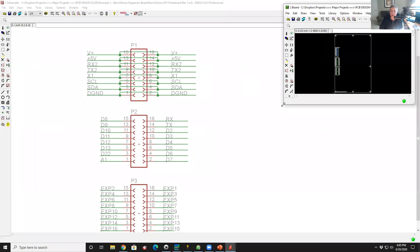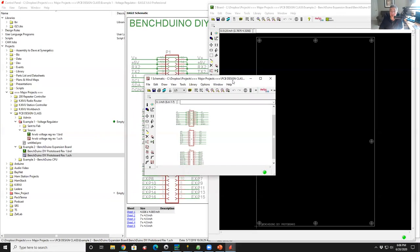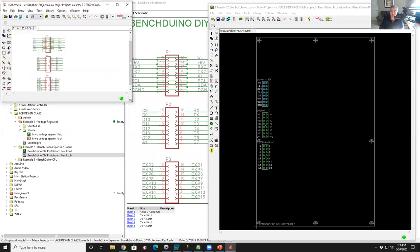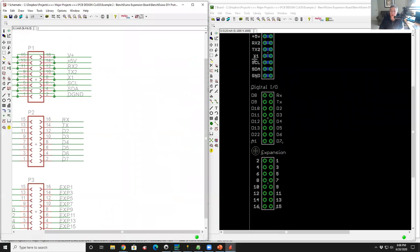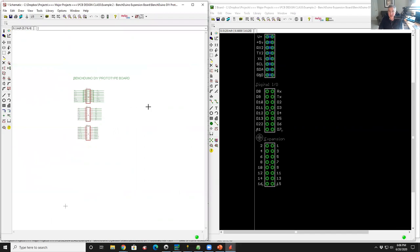And the reason why this is what you start with is that we defined exactly what the outer board dimensions are and exactly where the interconnect pins are, so that if you fabricated this, everything would line up properly. So you don't have to figure that out. Everything else is up to you. So we've predefined what those signals are that are coming off of the Arduinos. So if we were gonna do a simple circuit here,